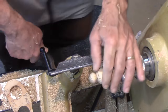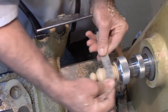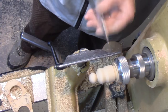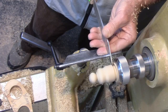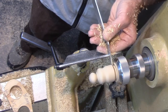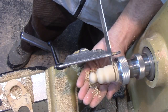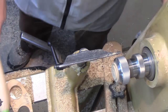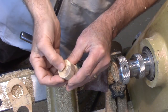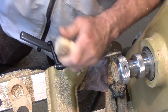We could sand this thing off — frankly it's close enough and probably doesn't need much sanding. I'll hit it with some 220. I'm going to switch to my fluted Sorby thin parting tool, two millimeter, because it makes a nice clean cut on the bottom. Ease it in, come back a half a thickness, give it a little more clearance so it doesn't bind, then go back in. Once you finish parting off you'll probably have a little nubbin — you can either sand that off or take your skew chisel and just easily cut it off. And there you've got it.